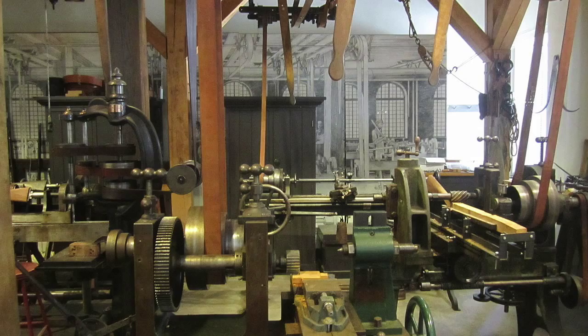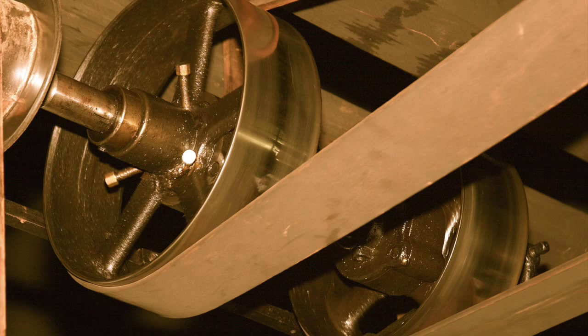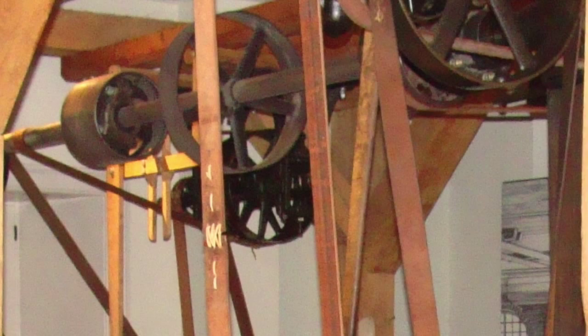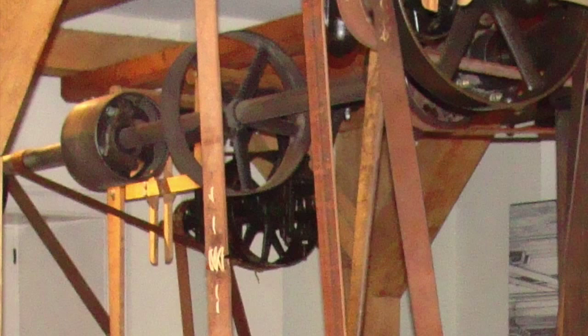He could capture more raw power by adding leather belts and widening them, increasing the belt's traction, much in the way a modern-day automobile's wider and thicker tire can. So, when he was transmitting much greater force through the leather belts and pulleys, the more substantial belts would also not stretch and wear out too quickly. He could reduce, that is, or generally regulate the power transmitted to the machine with similar substitutions.